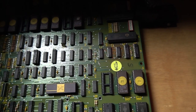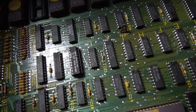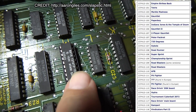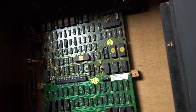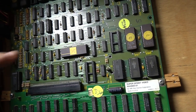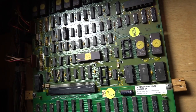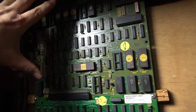Our main problem is this processor — it's definitely wrong, so we're not going to get far with it like that. The slapstick security chip has 108 on the end, which relates to Super Sprint, while 109 relates to Championship Sprint. I could take the right processor out of my Championship Sprint, but the one provided has broken pins, and I don't want to destroy my only working Championship Sprint processor. Instead, I'm going to swap the whole CPU board over, since these System 2 boards should share the same CPU.